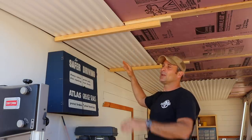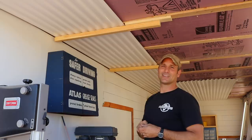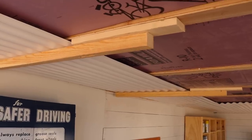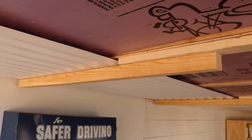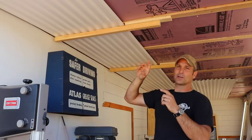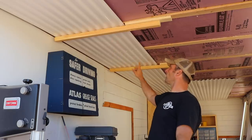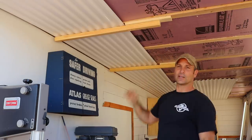They are pretty flexible and only one pair of hands makes it tough work. So what I've gone ahead and done is made a couple of brackets just with some scrap wood and I've just screwed these directly into the ceiling. It just provides a little way to hold the panel up while I fasten it down. Basically each panel is sitting on these while I put all the rows of fasteners on, and then I move these back and put the next one on.